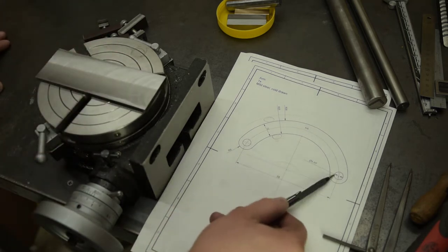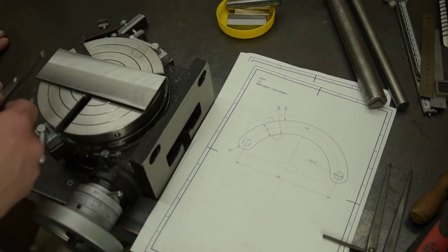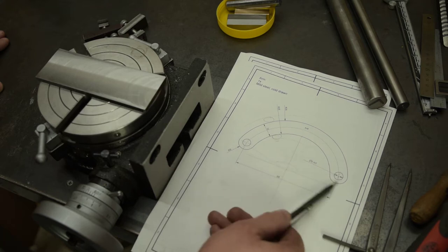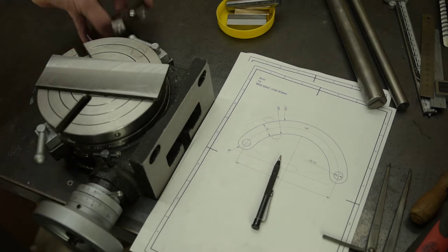I don't have a 5mm reamer. I may treat an end mill kind of like a boring tool. May use it in the drill chuck and poke it through. That's probably my most accurate way of getting an on-center, on-axis, on-size hole. That's the plan, but as always, it's subject to change.